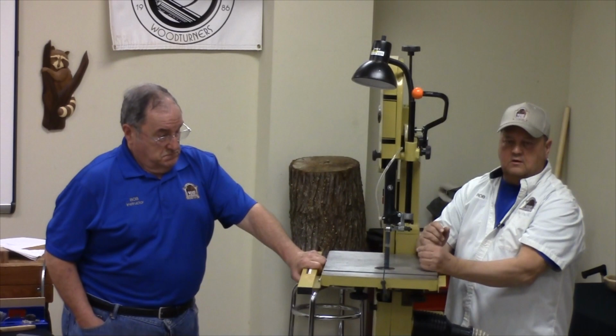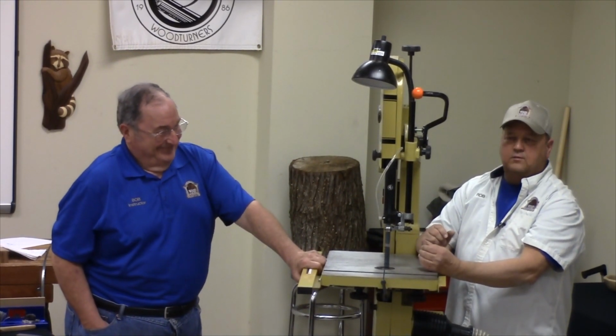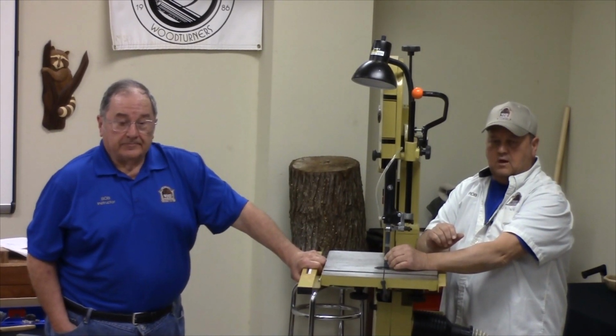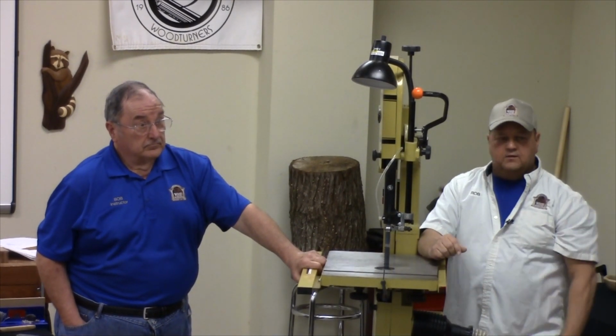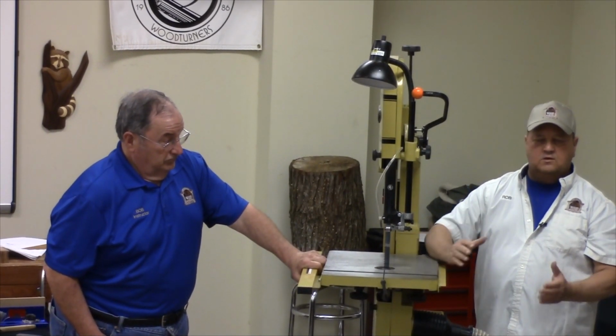We did get out the manual, which is odd for a guy. We made sure what blade size was the biggest you could put on there and got different information on it. And like I said, on something like this, Bob was talking about the teeth that are in there at one time. With a 3/4 inch blade, you're going to have about 2 teeth in here and the other one coming out each time, so it's cleaning itself out of the gullet. And like you said, if you use a finer blade, if you're doing 3/4 inch wood, you could have like 8 or 10 teeth per inch. It does do a fine cut.